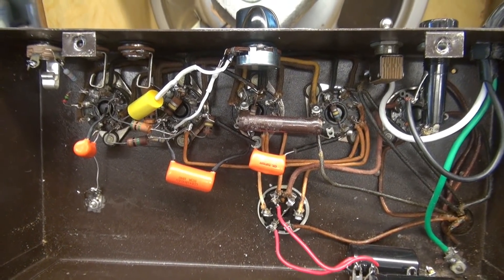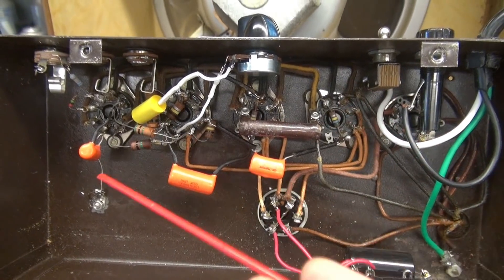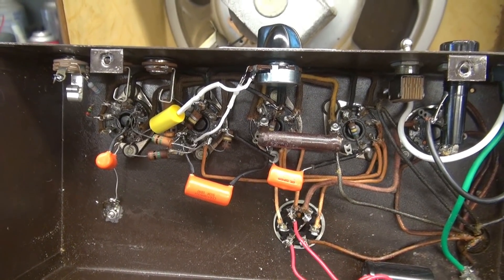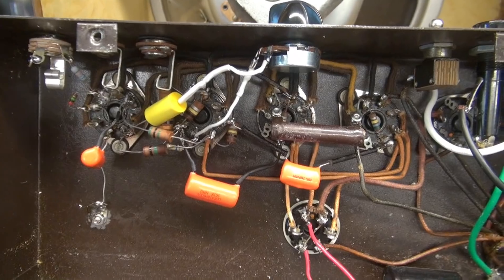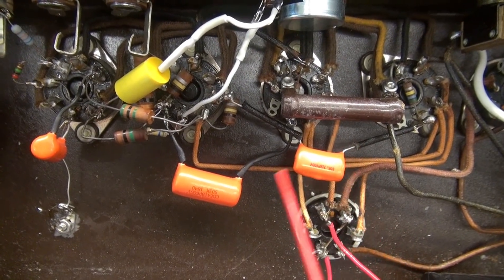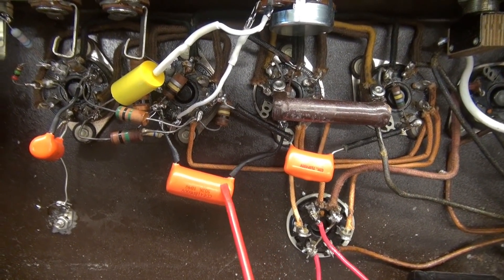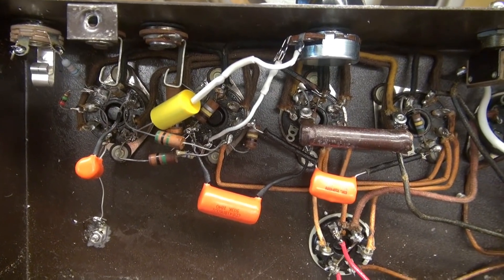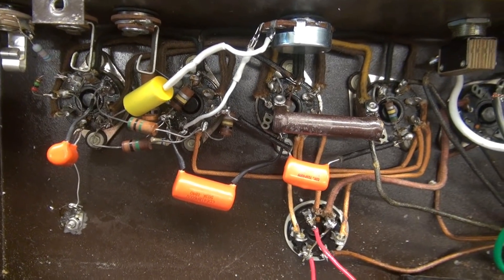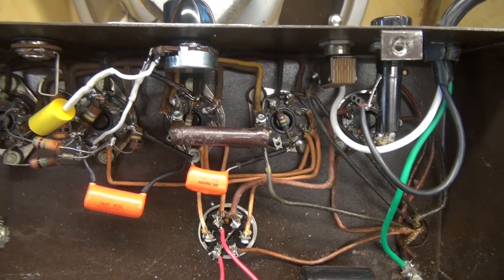I'm pretty confident the noise issue is resolved with the Gibson. So I'm going to continue on replacing all those old resistors. And unfortunately I'm going to have to change all these caps because after reviewing the schematic, I noticed that every cap in here that was previously replaced was the wrong value — these were supposed to all be 0.1 microfarads, and they're not. This is a 0.03, this is a 0.05, and so on. Somebody just threw in random stuff. The only one that's right is the one I just put in. So I'm pretty much going to gut the rest of this, redo it, clean up all these crappy connections, and we should be good to go.